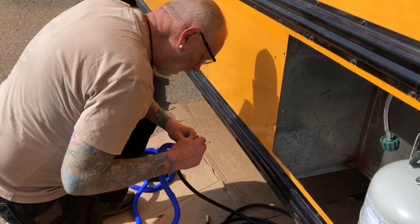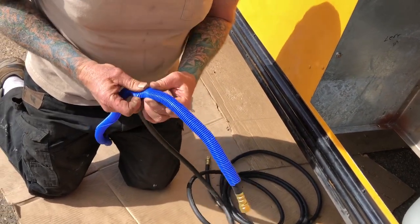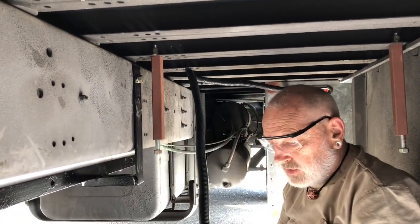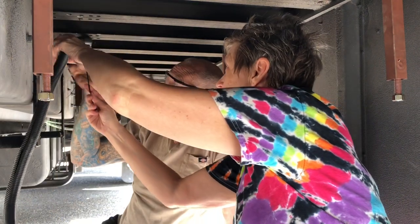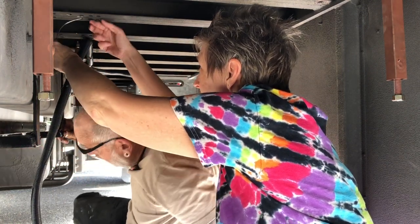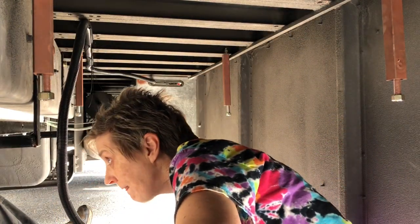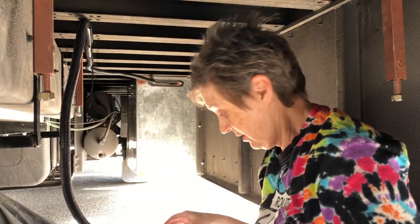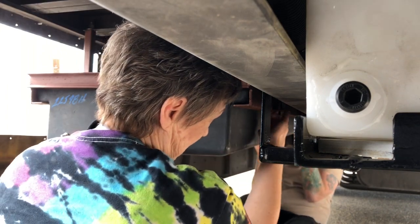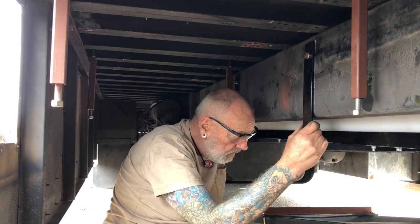We're getting ready to feed the hose right over to the stove and oven. We're gonna put on this nice protective coating. Put your zip ties through the two holes - see how they look. Don't crush it. We want to come across right where that middle thing is. Push up and spin your nuts off and it'll drop right down - they come off real easy.